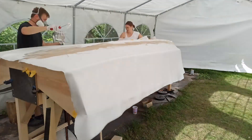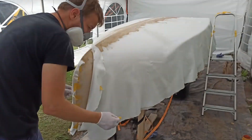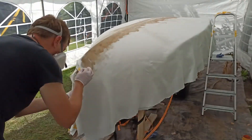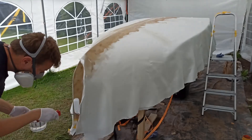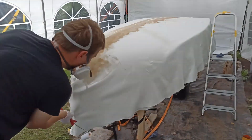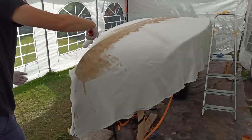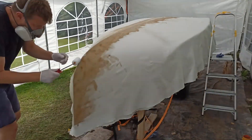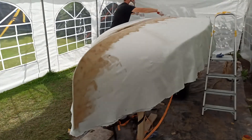It is extremely helpful to have someone assist you, as you do not have much time to finish this step. It is somewhat tricky to lay all four layers on top of each other in the bow area without getting air bubbles. To achieve good impregnation down to the wood, a fiberglass mat with good impregnation properties was used with burnt glass coating and a special finish coating, along with low viscosity epoxy, allowing both fiberglass layers to be applied at the same time.